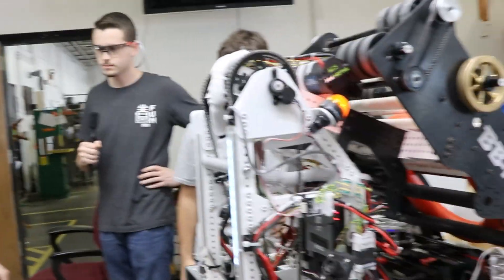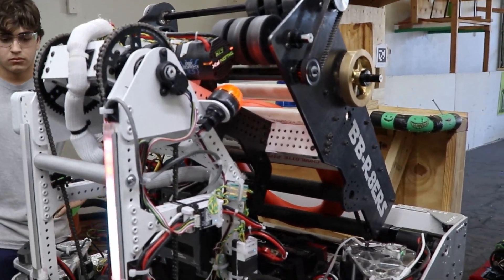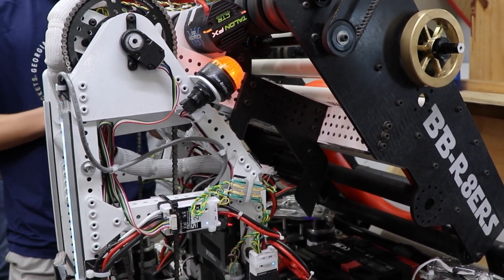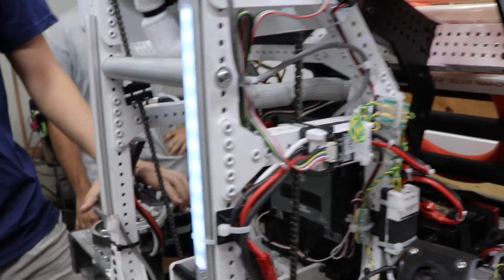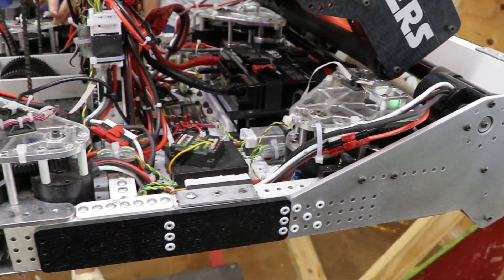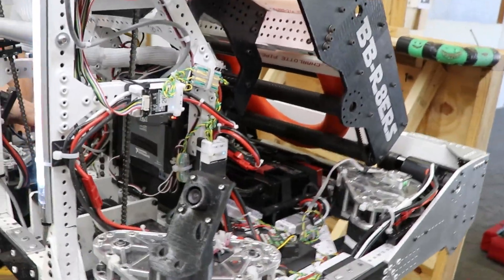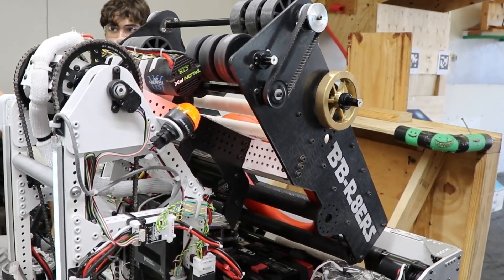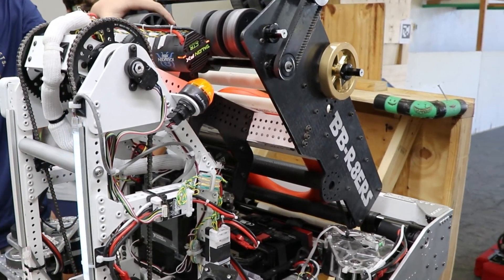As far as programming goes, it's a relatively simple robot to program because we have one degree of freedom, so we don't have to worry about collisions at all. We went more advanced into the control systems. For swerve, we're running our odometry at a higher frequency than the rest of the robot code to get more frequent odometry updates and hoping for more consistency on the field for auto. Our arm is motion profiled and characterized using SysId, which allows us to optimize how fast the arm rotates and gets into position to score as quickly as possible.